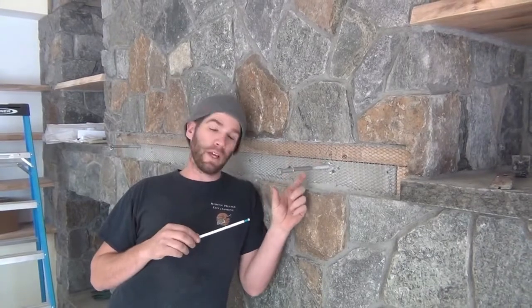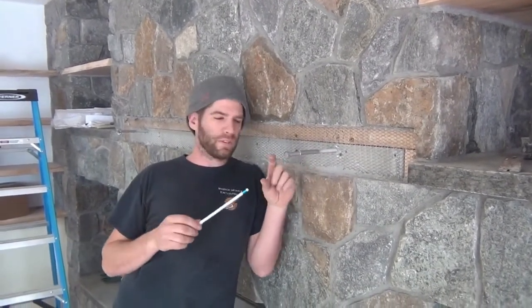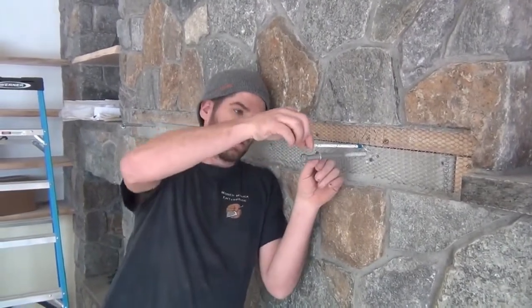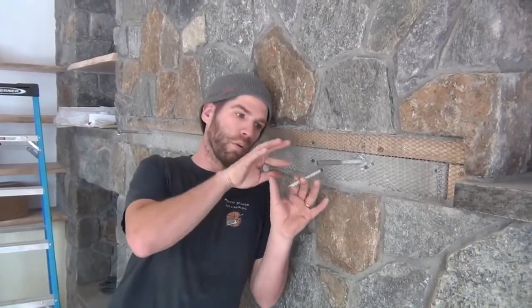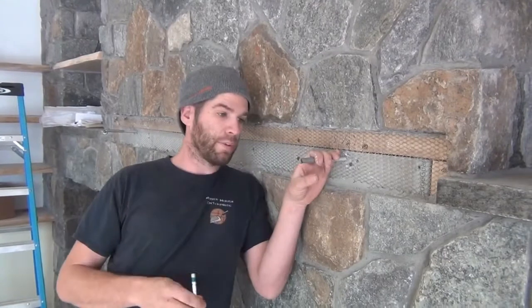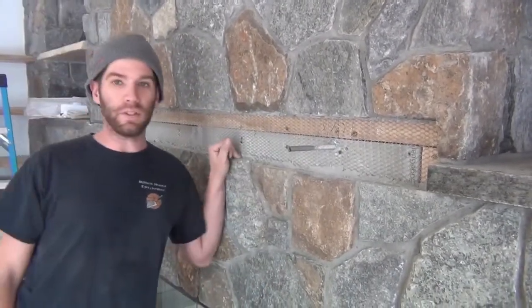The lag screwed the full depth to the end of the stud. I've measured the depth of our hole and we've stayed about an inch away from the end of the mantle. The hole is just about the length of this pencil. We cut it off a little bit shy of that, because we're going to be putting glue in that hole. We want to have a place for that glue to seat in and not get hung up on the end of that piece. So that's the process — pretty soon we're going to glue it and see if it fits.